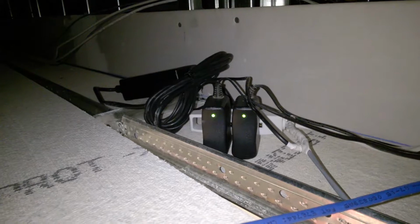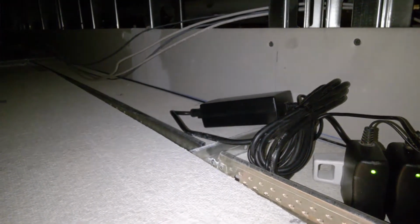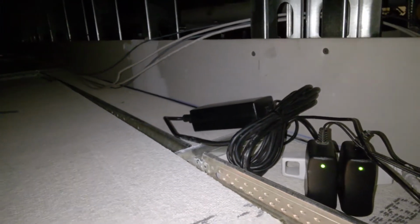So because I didn't have a power supply, I had to do a lot with just power bars. So I got 2 500 milliamps running the camera each. I have this block over here that's good for 3 amps of 12 volts. It's handling the other 8 cameras. This is where all my connections are. Actually no, I guess this one is. That one over there is for the other cameras, but it's still another 3 amp block. Most of my connections are all here. I kind of pigtailed all 8 of them to one section and then went there.